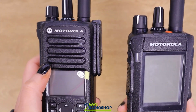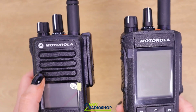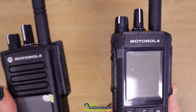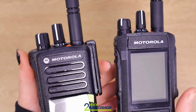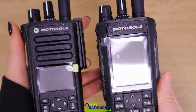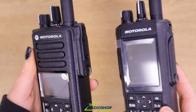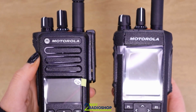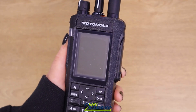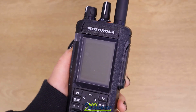Motorola has actually redesigned the accessory connector for the R7 to make it corrosion proof. This design should help increase the longevity of your radio, as often radios need to be repaired or rehoused due to damage to the accessory port cover. When the DP series radio's dust cover is removed, it does compromise the IP rating of the radio — this is standard with many two-way radios — whereas with the R7, removing the dust cover has no impact on its IP rating. Both devices are rated IP68, which means they're completely dust-tight and waterproof, and can be submerged in water of up to two metres for up to two hours. The R7 is also IP66 rated, meaning it's been tested to withstand direct impact from a highly pressurised water source, such as a jet.